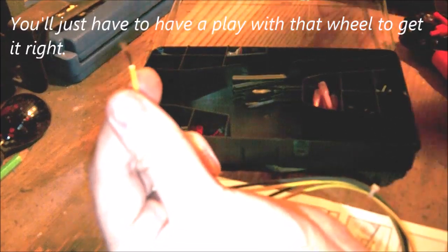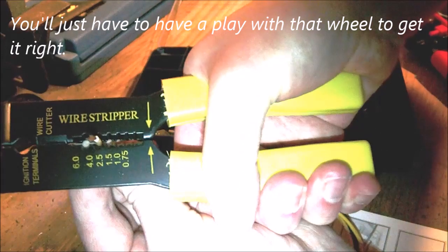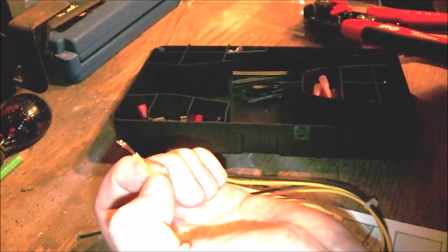And it's just a really straightforward, easy, simple way to do it, as opposed to this kind of method of squeezing and then pulling the wire up. What I usually tend to do is use orange handle scissors, lightly cut the wire and pull it off, even though I've got those kind of strippers. With the previous type, the Tool Zone ones, you can generally put too much on, and it pulls the wire as well sometimes, so you've got to be careful with those. It pulls the wire out and just cuts straight through it. But with these ones, you can't go wrong. A nice removal of the sheath if you have to do any electrical work.